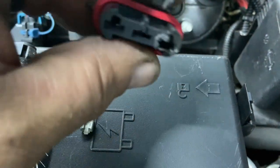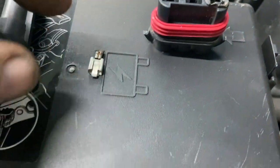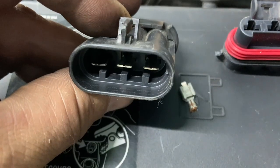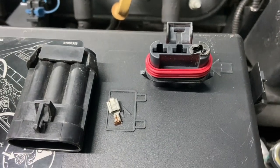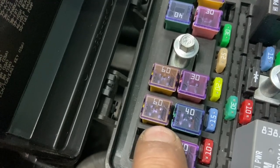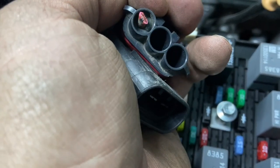Here is the connector — and as you can see, it's melted out. I tried to de-pin it just to show you, and you can see the pin beside it looks pretty stout. The end one is all blackened and the middle is burned out on the left-hand side. I looked up this connector series and the spec I can find is rated for 46 amps. That doesn't make a lot of sense when you're protecting it with a 60 amp fuse. So if you're running these fans hard, you're putting it right at the edge of that connector's rating — wonder why it burned out.